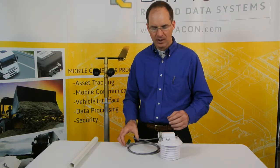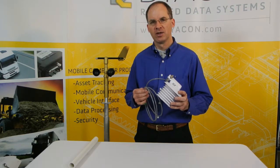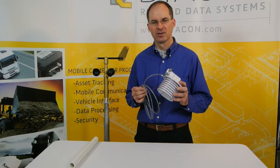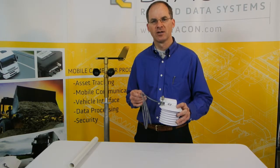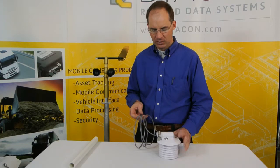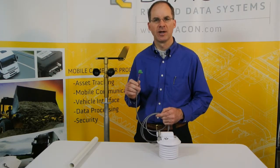Ambient temperature sensors can be expensive devices. When we designed the Diacon ambient air sensor, we wanted to include as many features as possible to facilitate the installation as well as provide the best value for the customers. We did this by including not only temperature, but relative humidity and barometric pressure into a single unit. This is an active sensor with a digital processor on the device. The data is available either by RS-485 Modbus or SDI-12.